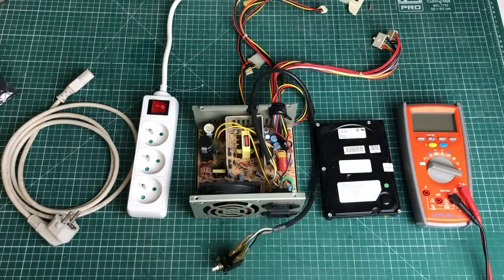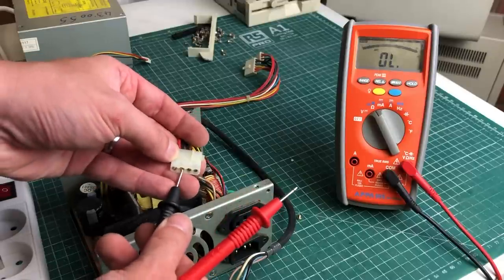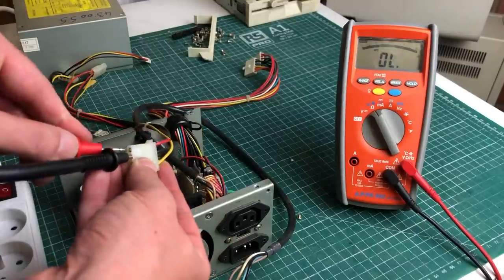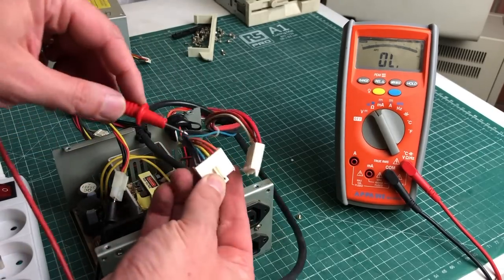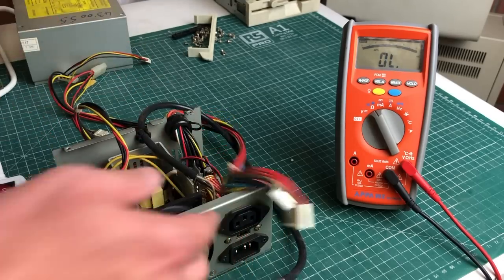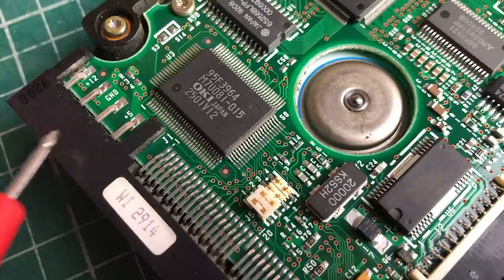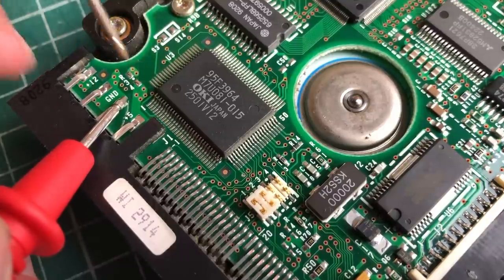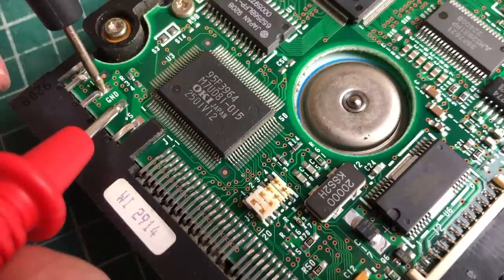We're back at the bench with the power supply all cleaned up. I've got my multimeter here — first thing I'm going to do is check if there are any shorts. The Molex connector gives you easy access to the 5-volt and 12-volt rails for a quick check. To check the other voltage rails you need to check the AT-style connectors which expose all of the different voltage rails. There don't appear to be any shorts. Since I'm going to be using this hard drive as a load, I'm also testing to see if the hard drive isn't causing a short — I've seen from time to time that some hard drives fail short on the 5-volt rail. This one turns out fine, so we can check the power supply and the hard drive in one shot.